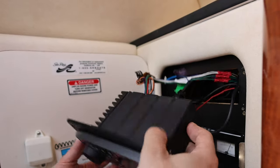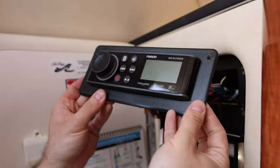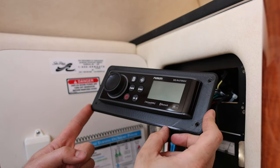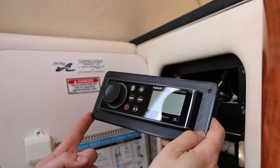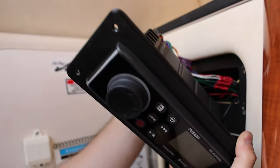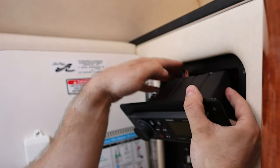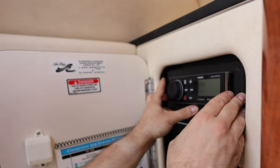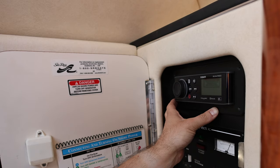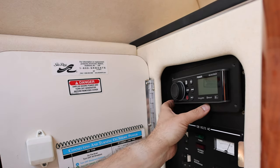Then you'll have to figure out how to fit a smaller radio into the big hole left for a much older, larger radio. That's where this filler bracket or adapter plate comes in. I do make these and sell them on eBay and Amazon — I'll put a link in the description. I've got another video that goes into more detail on this. I make them for a handful of different Garmin or Fusion branded radios. Once everything is taken care of, stuff all the wires back in, line up the screw holes — mine matched up with where the old Clarion was — and put your four screws in to secure it back in the panel.